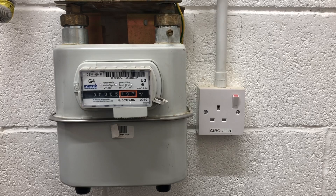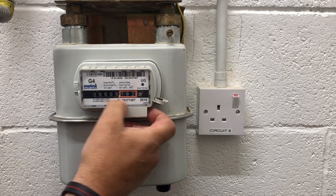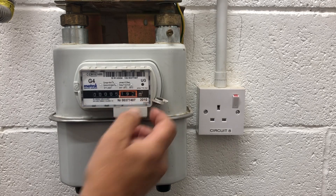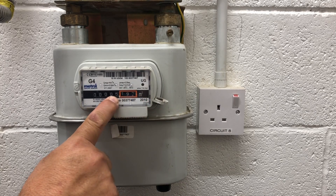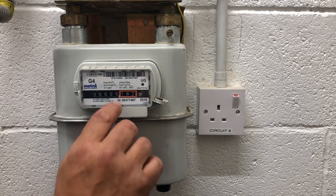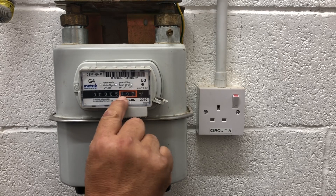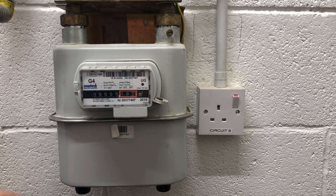The principle is the same: that meter is now full of gas, and once it's full of gas it's safe. What we have here is a G4 meter, and we're looking at these three numbers for the purge. They're in decimetres — 1000 decimetres would be one metre cubed. A decimetre is effectively the same volume as a litre. This is showing 195. The purge target will be 205 — when we've passed 10 decimetres it will read 205.